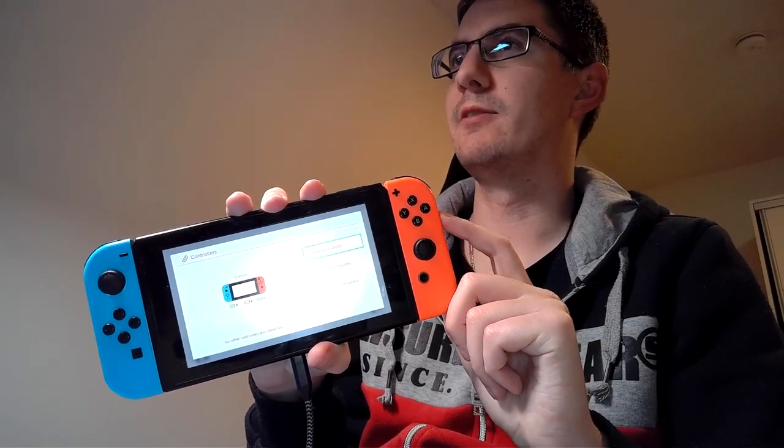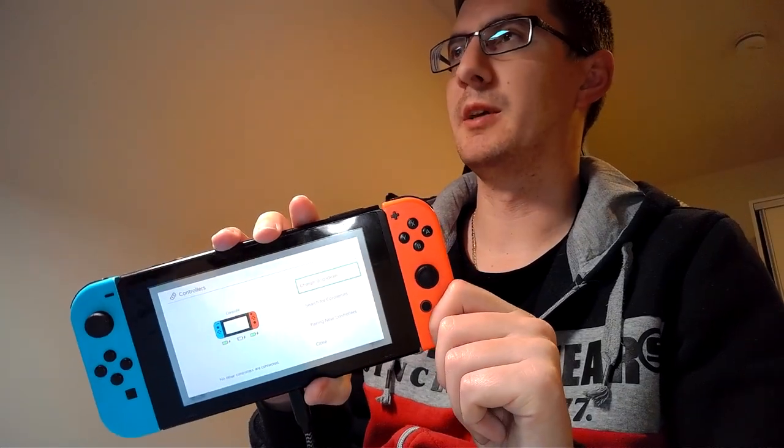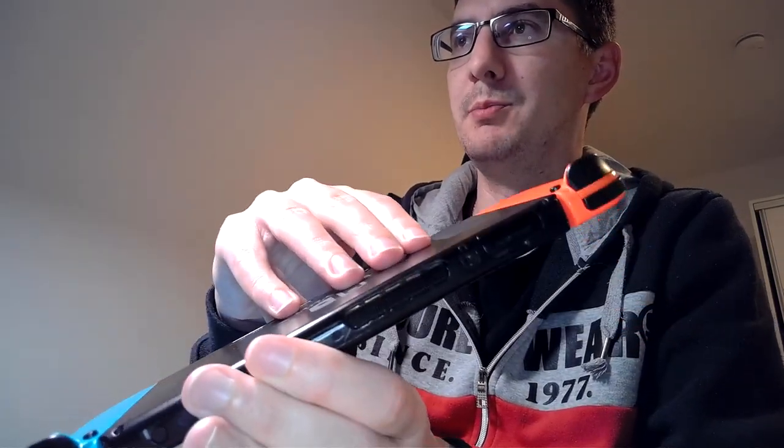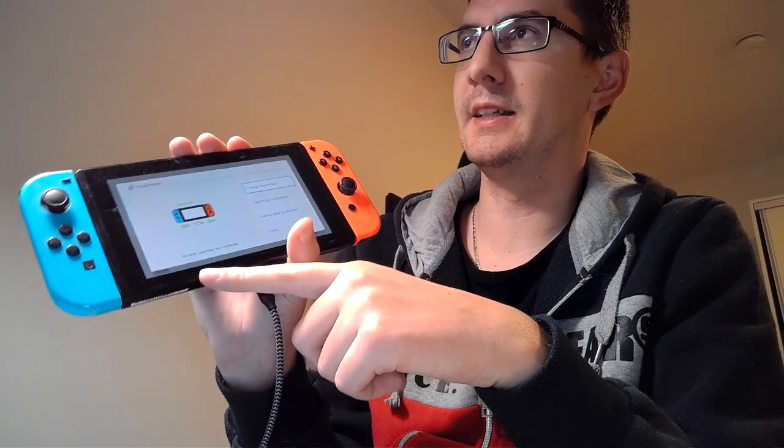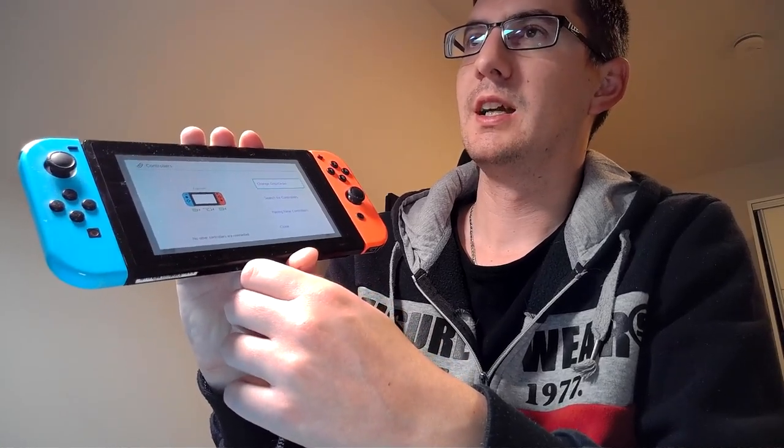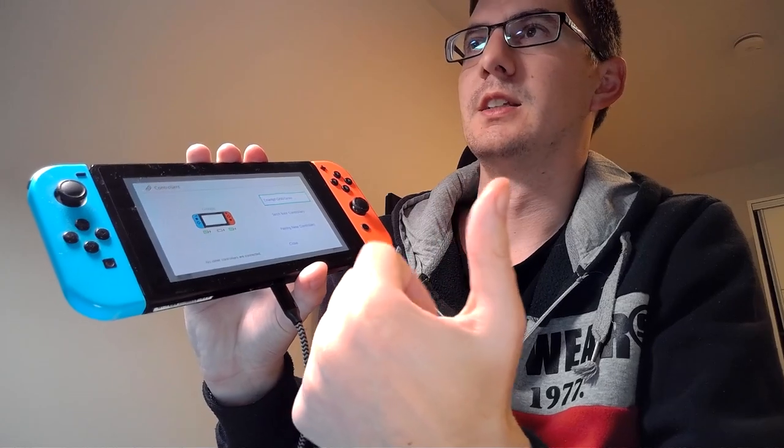So we do not know if it's really the fan itself or if there are some other issues, like it being disconnected or anything like that. This switch is in pretty bad shape — the grill is broken off, a lot of screws are missing, somebody was already inside. But most probably we can tell the charging circuit and the 5-volt rail itself works, and it could be a disconnected fan or a fan which failed in open circuit mode without pulling down the rail. So let's take it apart and see what the problem is.